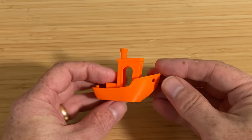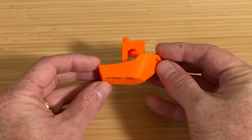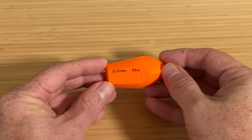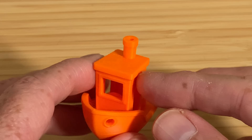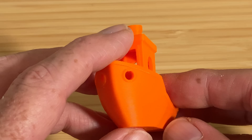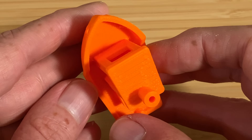Next I wanted to see if there was much difference between the normal and quality settings in Creality Slicer. So this Benchy was sliced using the quality 0.2mm settings and took 46 minutes to print. It looks good with no ringing and no wall gaps — I think it came out great.